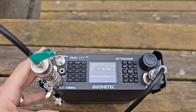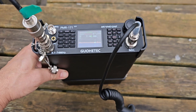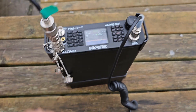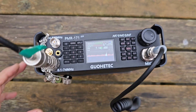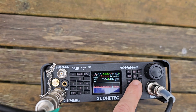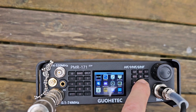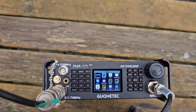It's not too busy on it at the moment — it could be the antenna — but let's just call anyway. The nice thing is we actually have a built-in antenna tuner, so if you press and hold, we can actually test the SWR by turning.